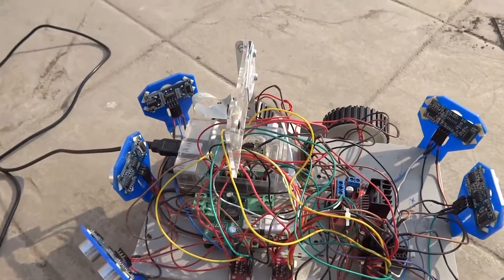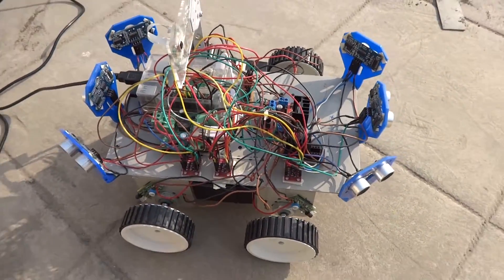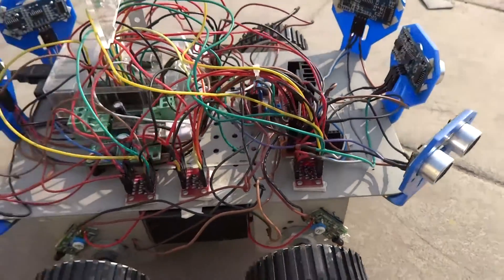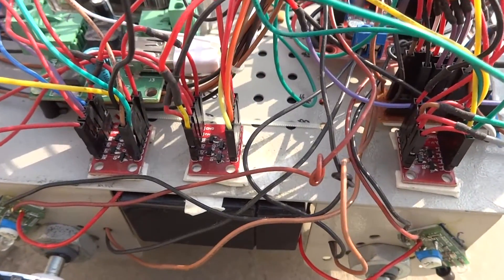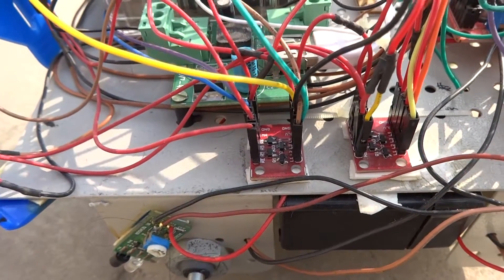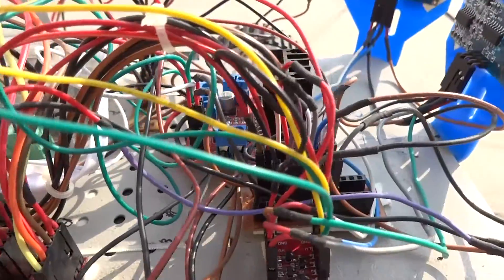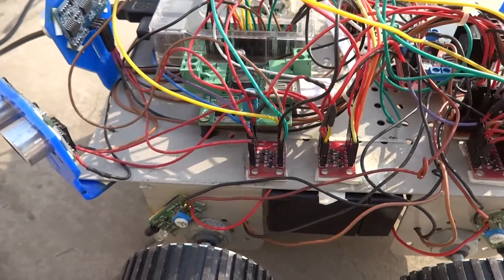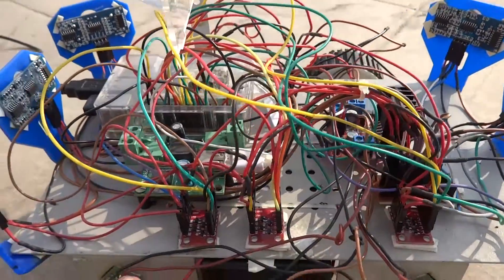There is only the Raspberry Pi to which all the sensors have been wired up — no separate controller. These sensors actually run at 5 volts, not the 3.3 volts that the Raspberry Pi runs on. So we have three separate bidirectional logic level converters. They each take four inputs or outputs, and step down or step up the voltage. We have three for six sensors because each sensor has two input/output lines.